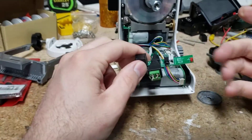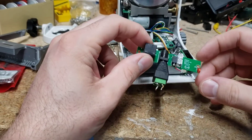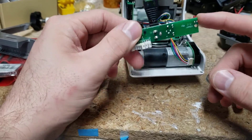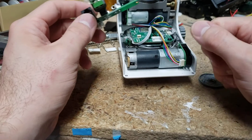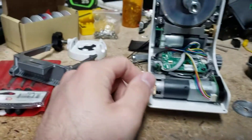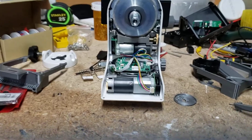I might use the LED. I would just put a new one in. The resistor doesn't seem to be on this board, so it's probably in there, in which case I can just probably slap any red LED or any LED really on there and it'll light up.